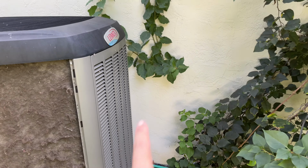Just use water, fairly low to medium pressure. You don't want strong pressure to damage the coil by itself. Just be really careful. Test on a small area first before you apply pressure and rinse down the whole thing, okay? Otherwise, the machine's working perfectly now.